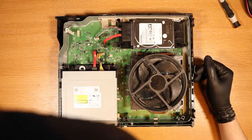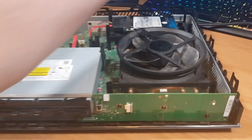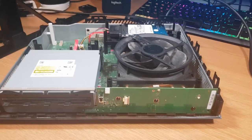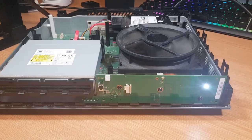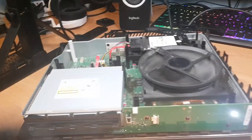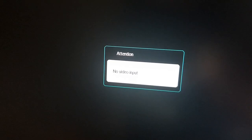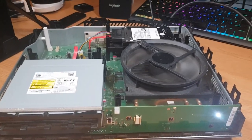I'm going to take you over to a different camera to see what actually happens on the TV screen. I'm just going to plug in the power cable at the back — this is a known good charger. Fan spun a little bit. Now we're going to turn the Xbox on. It's staying on — it's not turning off. Do we get an image? Nothing just yet. I've also changed the HDMI cable. When I pull the HDMI cable out, eventually on the screen it does display no video signal. The fact that the Xbox is still on is a good sign. But I think there's something wrong with either the HDMI chip or the HDMI port itself. Let's investigate.